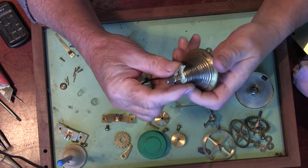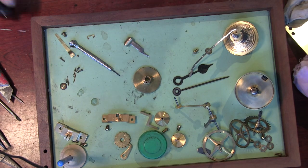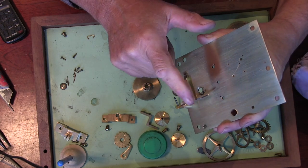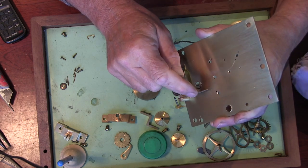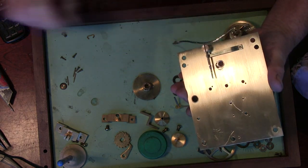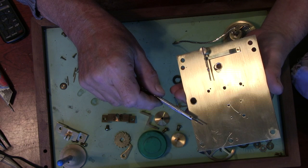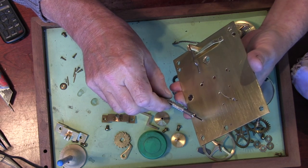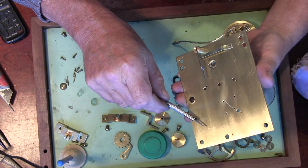Just making sure it goes down into its grooves. Here's that lever in place and the spring, so that it's held off of the fusee until the chain pushes it across. I don't know if the camera will pick this up, but just here are my initials from 1984 when I last cleaned it — at Brixton College. This was my mum's clock and I did it in 1984, and there are my initials for 2021.